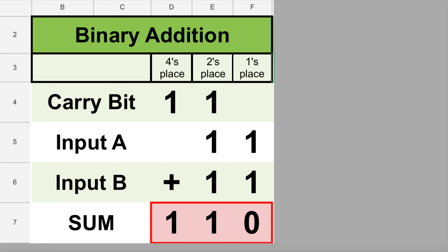So now we know why we need a full adder to add 3 binary bits together. Next, you're going to make a logic table for a full adder. You can print a blank table from the link in the description, or simply pause the video and draw out the table you see on the screen. Notice that the three columns on the left are the three input bits which need to be added: input A, input B, and the carry bit, which we'll call input C. And the two columns on the right are the two output bits which comprise the sum — the sum of a full adder is A plus B plus C.